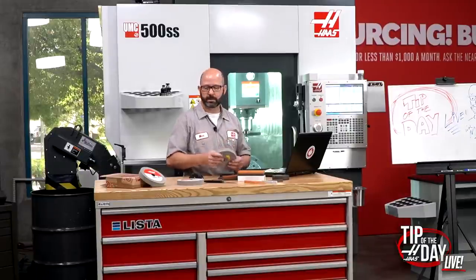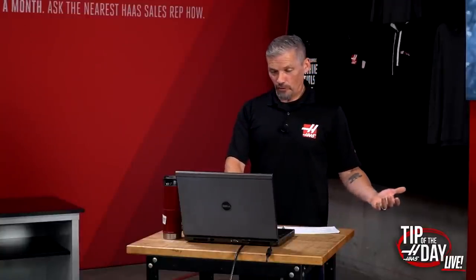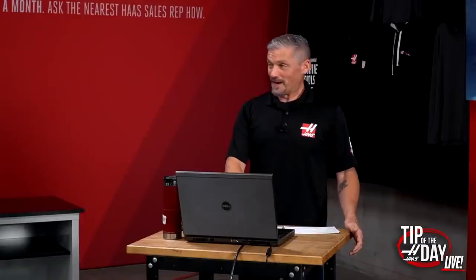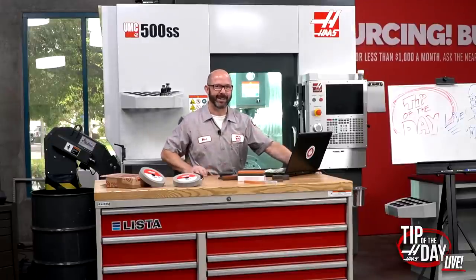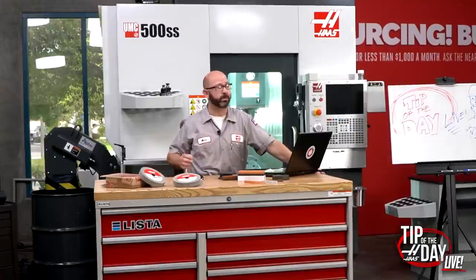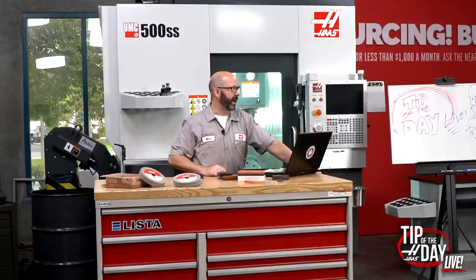A comment from super-AWACS says after Arkansas stones you have ruby stones for the finest work. I've never used a ruby stone — that must be incredibly sharp. We also use diamond paste with a lapping board; lapping is a whole different thing that just keeps getting finer and finer. But for the machine, if I'm using a bench stone I'm going to use an aluminum oxide stone.